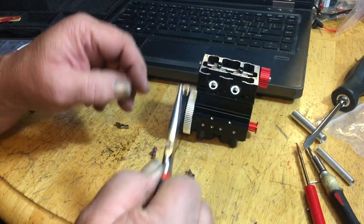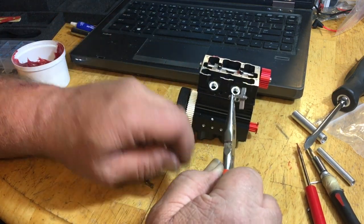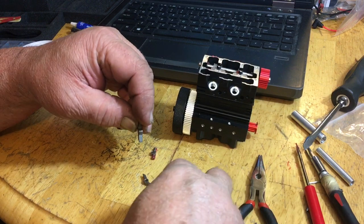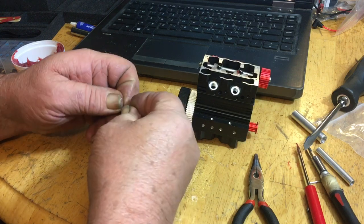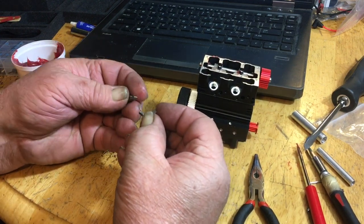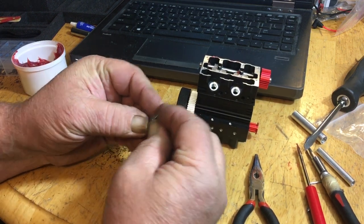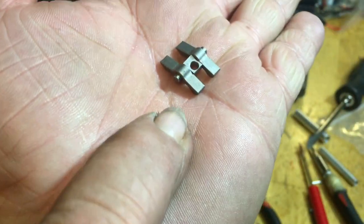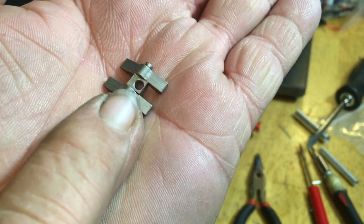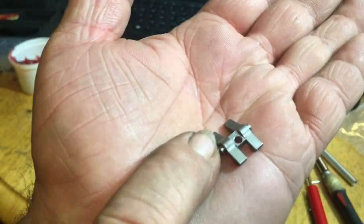And so when you load your rocker arms on there, you make sure that you put the camshaft on one side and the lifter on the other. I know you can turn these around after you get them put together and everything, but I try to still kind of make them work. There. So, this is what you should have when you're done: the two bumps on the bottom over here, the hole's recessed all the way towards the valves. And then these here are just followers. They'll just jump up and down.